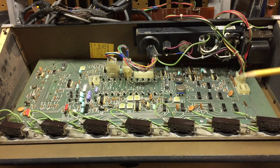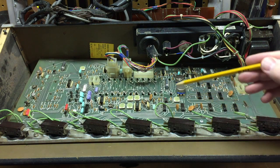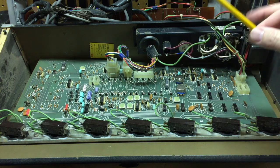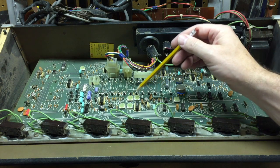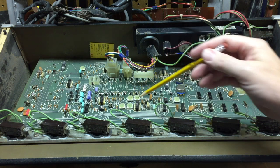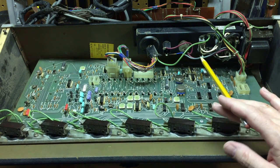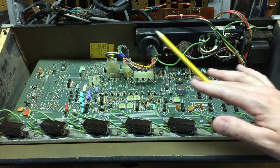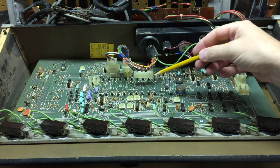I've flipped this thing over so we can see it better. Here's the power module we were looking at earlier. There's a second section attached to the fiberboard that we're going to have to deal with. It's got some electrolytic capacitors, and we're going to be replacing pretty much all the electrolytic capacitors in this, because after a couple of decades the electrolyte evaporates and they don't work nearly as well. We're also going to replace the potentiometers with Cermet — C-E-R-M-E-T — ceramic metallic potentiometers, which Moog recommended in a 70s update because they're much more heat-resistant and hold their tune a lot better.